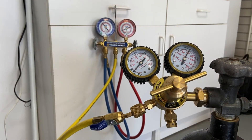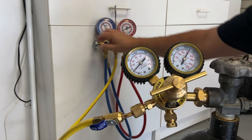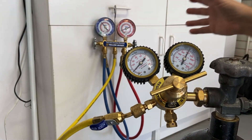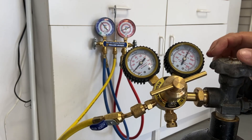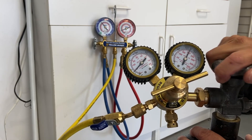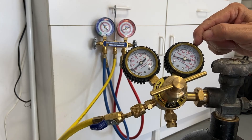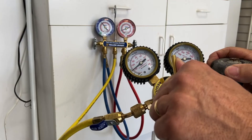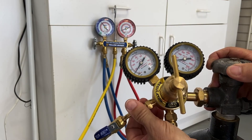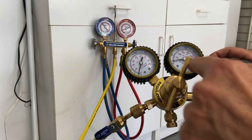Now I'm able to pressure check. As soon as I'm done pressure checking, I shut my valves off, search for leaks or verify I have no leaks, and then I can drain out the nitrogen — no problems with the EPA regarding purging nitrogen, not a problem at all. I'm going to close my valve, and then I want to purge out the nitrogen out of my hose and back out my regulator again.